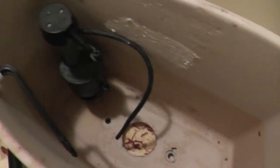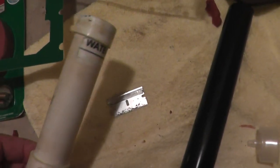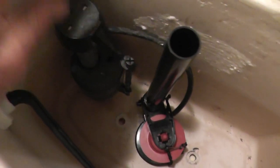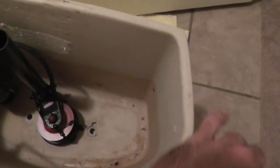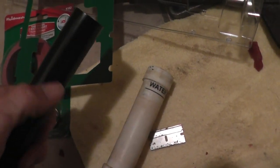I've cleaned the silicone off the tank, so I'm ready to install my new flapper valve and flush assembly. It looks like a nice quality unit, especially for the $3.79 I got it for. Before I install it, I need to cut this overflow pipe to the same height as the old valve. The purpose of the overflow pipe is to allow water to pass through into the bowl if this valve sticks open — if there was no overflow pipe, water would come up over the tank and into your bathroom. So we want to cut it to the same length as the old one, and I'll go cut it with my hacksaw right now.